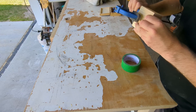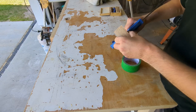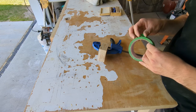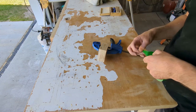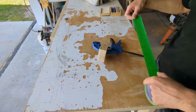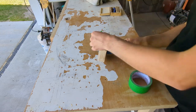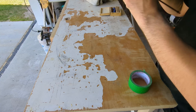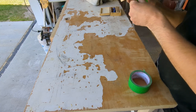Line up all the edges, clamp them together, and grab some painter's tape. I've made jigs and fixtures in the past to hold these together, and honestly, keep it simple — tape's the way to go. Wrap the tape around them, then grab a combination square and tape measure, and mark in half an inch from each side on one of the corners. That's where we're going to drill the hole for our dowel.